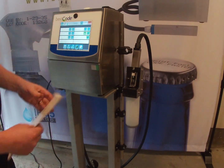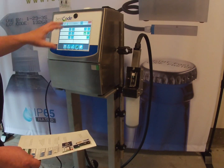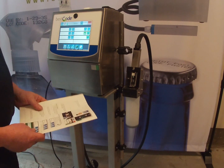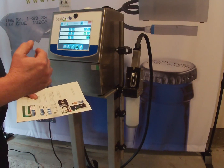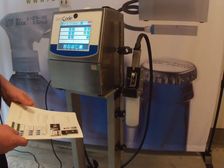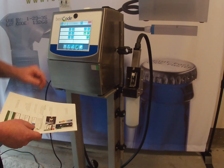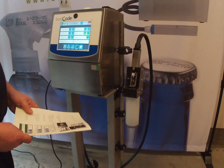So now, while we're in this screen, the next part is verifying the modulation. Verifying the modulation requires the printer viscosity to be within range. Now, what we've got is a target viscosity of 4.5. What we mean when we say in range is between 4 and 5, so 0.5 either side. So anywhere between 4 and 5 on the viscosity, we can then start to do our modulation calibration. So we're going to wait now, leave the printer running like this with the jet running until the viscosity becomes within range.